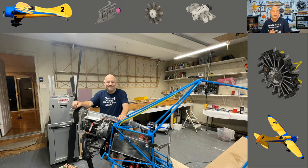Originally I was going to go with a 250cc belt-driven motor from the radio control world, but that engine all-up only weighed about 28 pounds. I was ignorant — I didn't look at what my CG would be before I bought that engine. Essentially, there's no way to get the CG right without hanging the engine out another 36 inches, which would look stupid, or adding 25 pounds of weight, which you never want to do to an airplane.